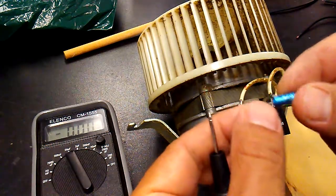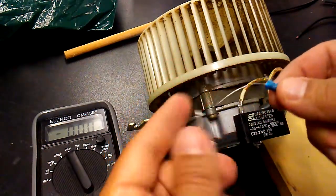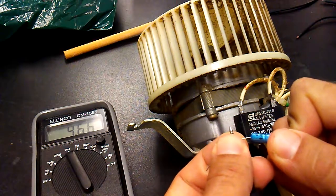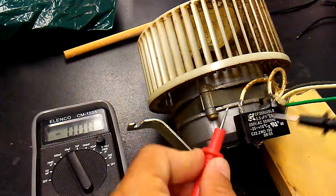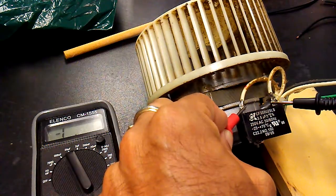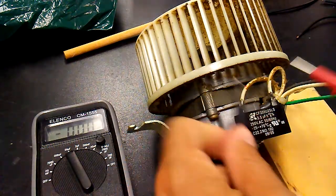Something a bit bigger, such as this one here, is a 4 micro farad, and this one reads 4.66. So theoretically the bad one should be giving 3.5, but as you can see I'm not getting anything from it at all.